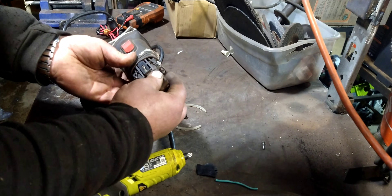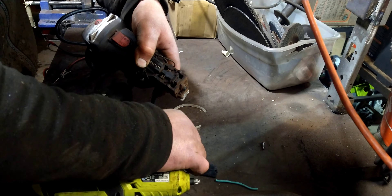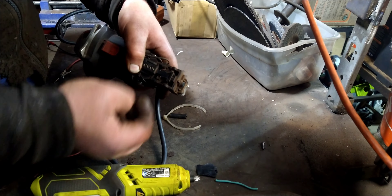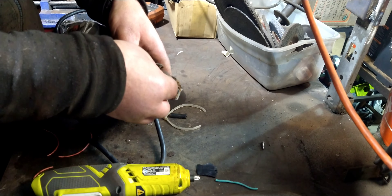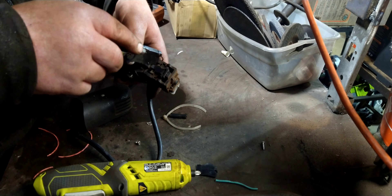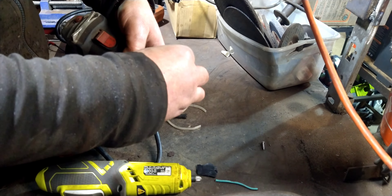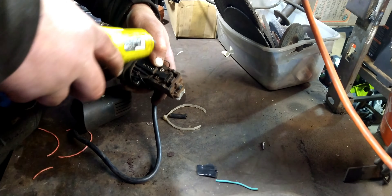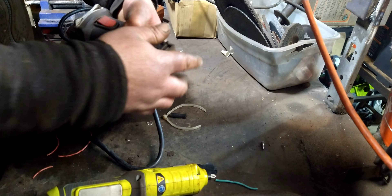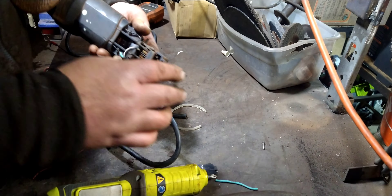The tricky part is going to be fishing these wires down in there. I don't want to take that screw all the way out — if I take it all the way out, I think something bad is going to happen, it's going to be a pain. There's a little nut behind that screw and it's got to be lined up perfect. I really should just use little through-hole connectors — I have some. Working hard instead of smart here. I was grinding on my truck over there and went to turn this on and it just wasn't. I figured I might as well make a video about it. Don't be like me — use through-hole connectors on this. It's a lot neater, cleaner, more dependable, and less chance of arcing or shorting the two live wires.